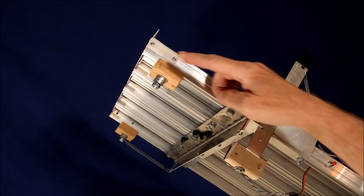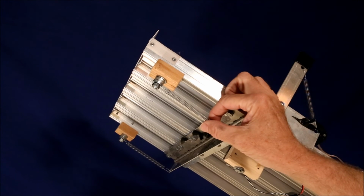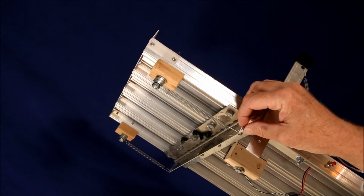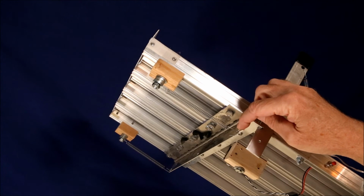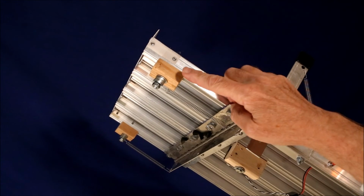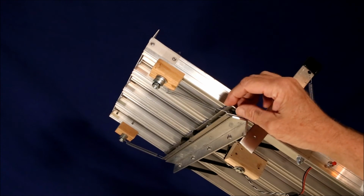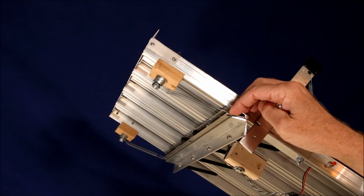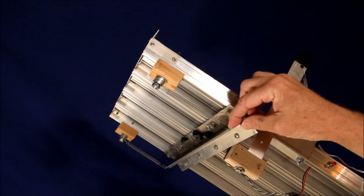Next, I moved the holding bolts for the springs forward about 2 inches to reduce the pressure. Most of the vibrations came from the back of the start gate slamming into the heads of the screws here. Bringing this down means that once it's pulled away, this actually helps slow the start gate backside down so it doesn't hit the mounting bracket.